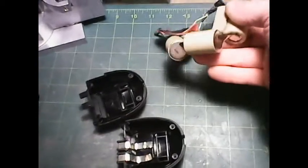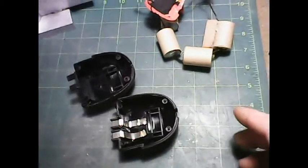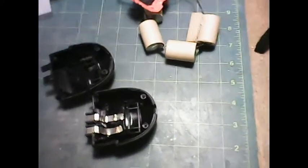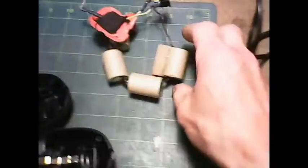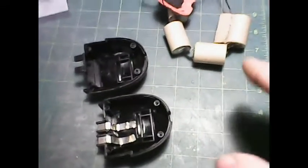I'm not going to get any kind of batteries like the originals. I have these C-sized batteries here that I can charge up — very easy to get. So I'm going to convert this using regular rechargeable nickel metal hydride ones that are very easily available, instead of buying the proprietary kind. I'm going to replace this in such a way where the battery pack is on the outside, and just use the original case as a cartridge to fit inside the drill.